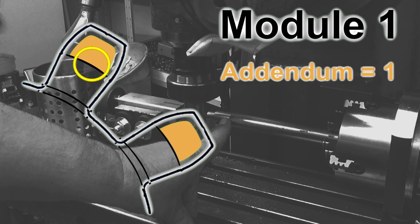The middle of the gear, also called the pitch circle, is also easy to calculate when the module and the number of teeth is known. The pitch circle diameter equals the number of teeth multiplied by the module. For example, for a 40 teeth gear, the pitch circle diameter would be 40, if the module is 1, since 40 times 1 is 40. Consequently, for a 16 teeth module 0.5 gear, the pitch circle diameter would be 16 times 0.5, which is 8.